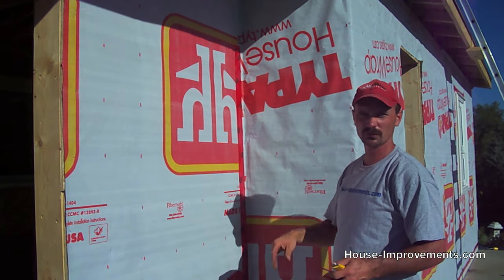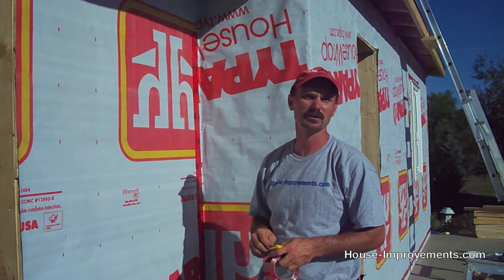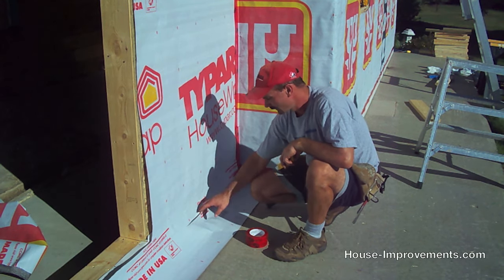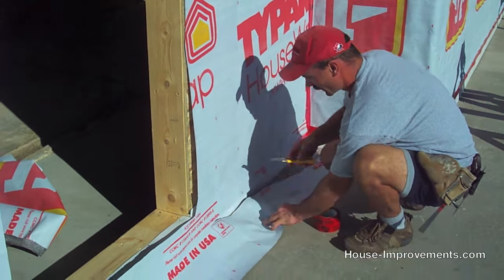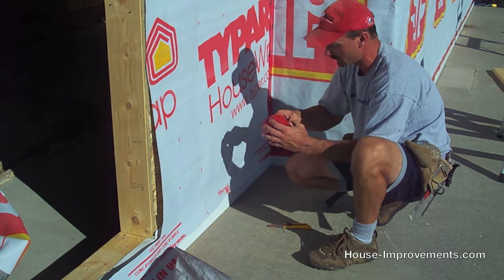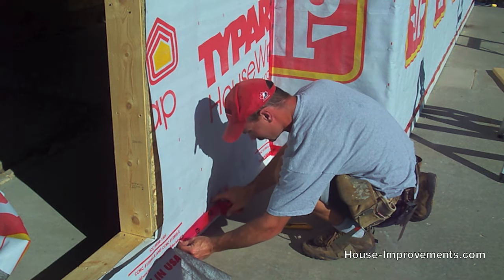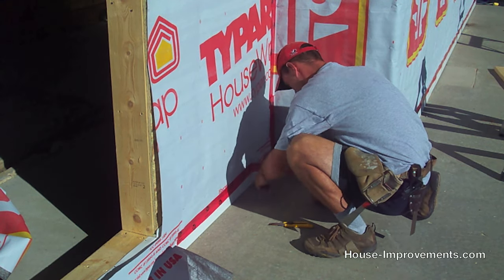That prevents any moisture from getting in between the two layers at any joints. Around the windows and doors, we will address that in another video about installing windows and doors. Once you've got all your seams taped, really all you have left to do is cut your bottom off to length and tape that as well. I would cut right across the whole width of the building at whatever level you decide is the bottom. Then I'm going to tape this down — I've got some metal coming up there, so I'm going to tape it to the white metal.